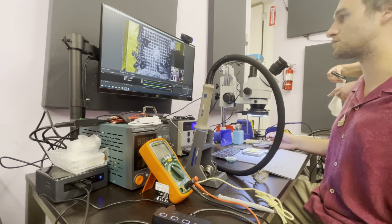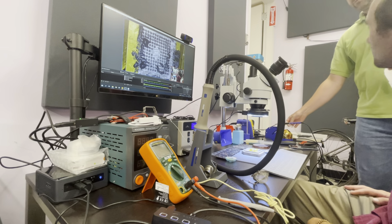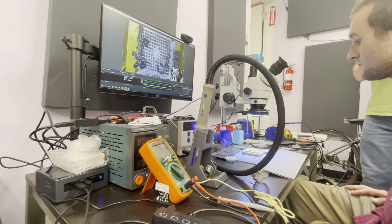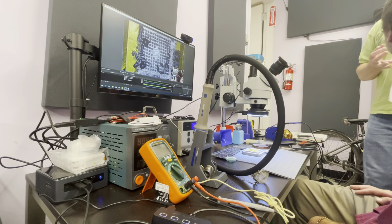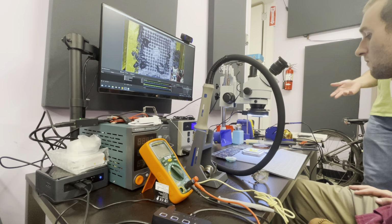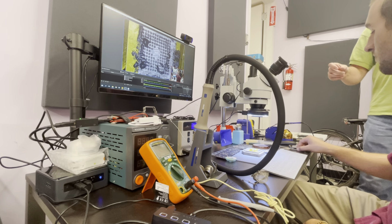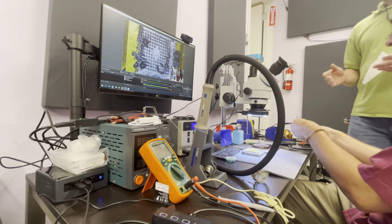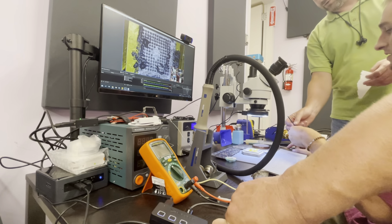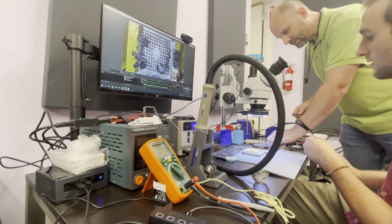And there's a safety consideration here. Whenever you work with solder paste, you need to be very, very clean with it. It's not only toxic to you, it's dangerous to your board. If you leave this on the back of your tweezers and you touch your board with it, you heat up somewhere on your board, that's going to melt in and short out everything that it was touching. So you always want to fully control everywhere where you have solder paste and clean it up immediately. Never let it get anywhere. Don't let it get on your hands.